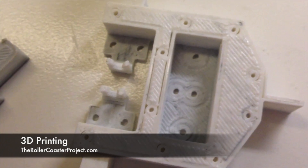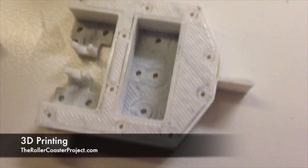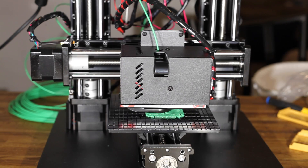One of the best features of the Trinus 3D printer is its all lead screw design, as opposed to the Solidoodle which was belt driven. Over time, as things would heat up or belts would lose tension, you'd actually get a fairly inaccurate part. The lead screw has a consistent pitch — every time it rotates it gives you the same measurement.